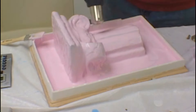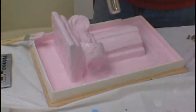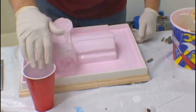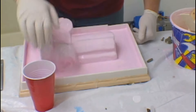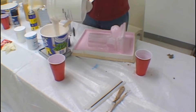After you've finished applying the second coat of silicone, you again may use a heat gun for bursting any bubbles in the surface. Don't put it too close to the surface and keep the heat gun moving around, as you don't want to cook the rubber. A very important step in silicone mold making is using denatured alcohol as a smoothing agent for smoothing out your silicone rubber. This works incredibly well. After you've poured your silicone base into your mixing bucket, the next step is to pigment this coat of rubber.